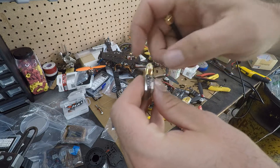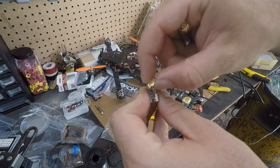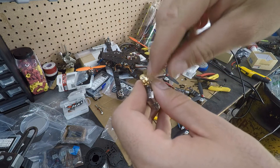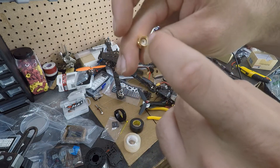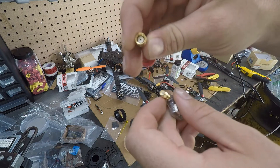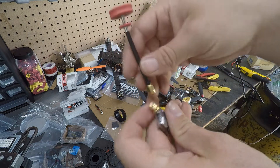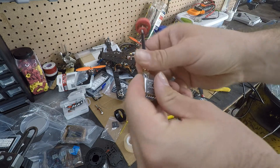So what I ended up doing was I bought the cheapest transmitter I could find on Amazon — $13 for this 200 milliwatt transmitter. All the cheap Amazon transmitters are RP-SMA, which means the connector configuration is reversed: the pin is on what you'd normally consider the female piece.